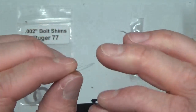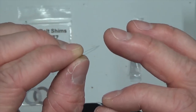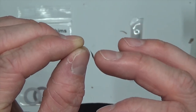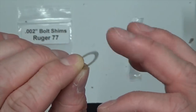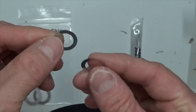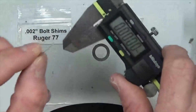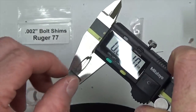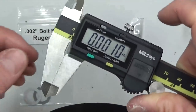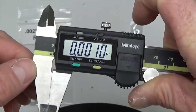These are one thousandths of an inch thick. To give you a little perspective, a sheet of paper is three thousandths of an inch thick, so these are very, very thin — it's almost invisible when you turn it sideways. The most impressive feature is the material and the cut. It's absolutely burr-free, which is amazing and hard to do. You can see it's .001 and it's got another zero in the fourth decimal place.